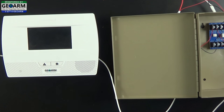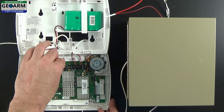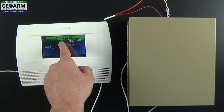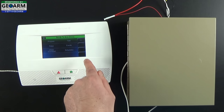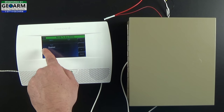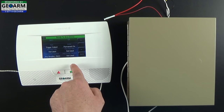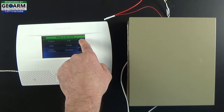We just need to get power to the panel and do some programming. Go ahead and plug in the backup battery as well as the transformer. Now the L5210 is at its home screen - hold down the home button to allow you to manipulate. From the home page select Security, then More, then Tools. The installer code by default is 4112. Select Rules, then the first available rule, highlight it, and select Edit. Activate it. Set Trigger Outputs. For Action select Permanent On. Then select Start System Operation, Any Burglar Alarm, Stop System Operation, and set it to Bell Timeout. Select Save, then back out of programming.